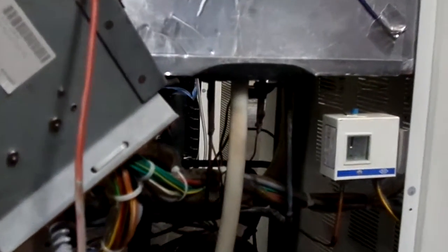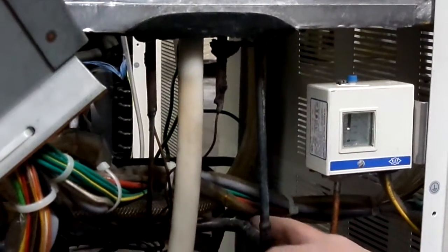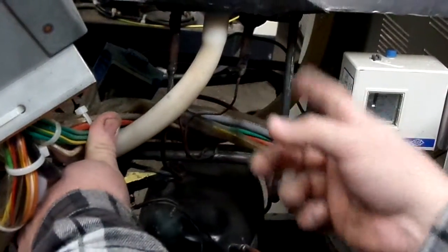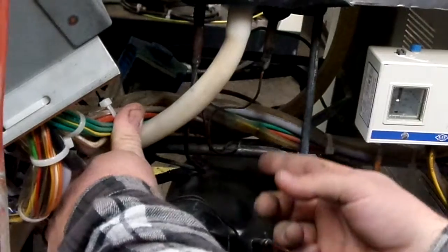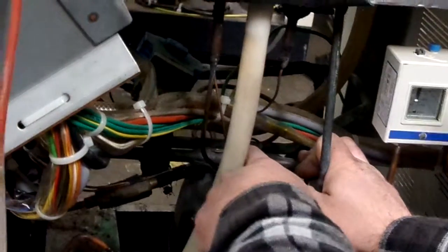And then you have a single return line on this guy. If you can see in here, our capillary tubes actually go all the way around there. They wrap around the accumulator on the other side, and then they enter the return line and exit the return line here. It's to cool the freon in the capillary tubes before it expands into these pipes here, getting much colder. So it's just an extra bit of cooling ability for these guys.